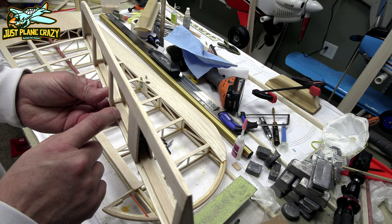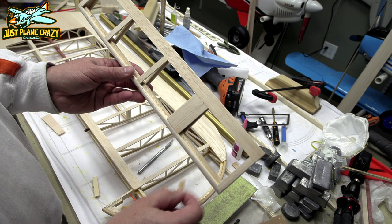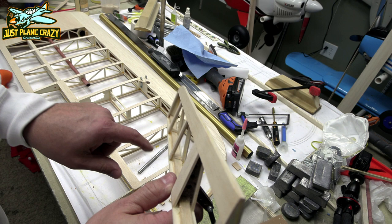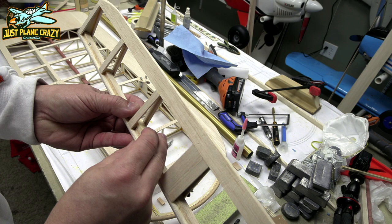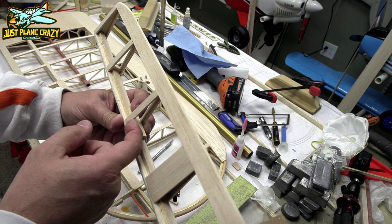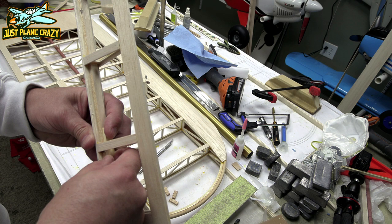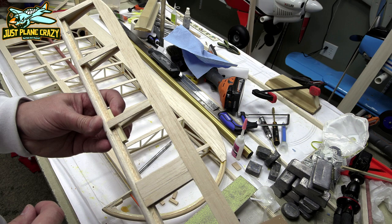And I've been kind of at odds struggling with what to do. I thought about putting some pieces in here, things like that. It's hard to tell in the book, but what I figured out for me is going to be the best thing. I actually cut that center piece out of that lower rib on this one, trying to show you guys here. And now I'm actually just going to take this one right here and glue that in, because that'll make that super flat. The epoxy will fill back in what was taken apart on that rib, and then I'll put some corner pieces in there to drop this down and attach this here. So I think that's structurally what I'll be happy with. I know that this thing's going to hold up to a good amount of force. And this is obviously hardened balsa. So let's epoxy that in.